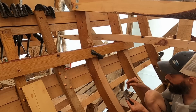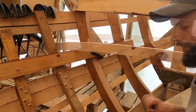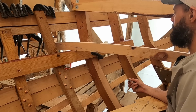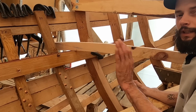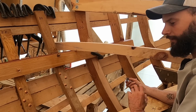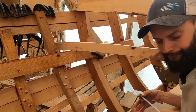Put in our gauge here. So, 20 degrees. So 18 degrees. So 18, 20, and 20. So I think if I cut this whole thing to 19 degrees, we can fit it in here and do a little bit of fitting, do a little bit of shaving on it, and it'll set right in there, as opposed to trying to follow it with the bevel saw and trade degrees as we go. So I'm gonna go get this cut out, and then we'll see how it fits.